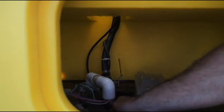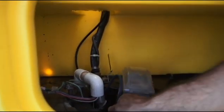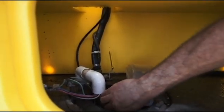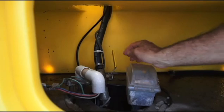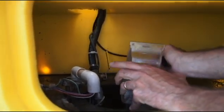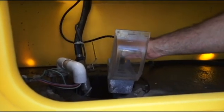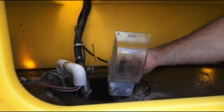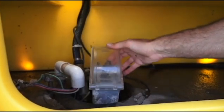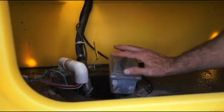You'll notice the remainder of my heat cable — I'm just going to snake that down into my riser tube, and that will help keep that riser tube area nice and warm for my water line. Just shove that in there as far as you can. The other end of my heat cable with my plug, I'm going to go ahead and plug that in. This is an enclosed water-resistant duplex box that we put underneath here — highly recommended. I can run the cord out through the slot and then close my cover. Any moisture that may be underneath the unit now is somewhat protected from my outlet.